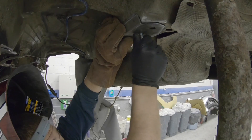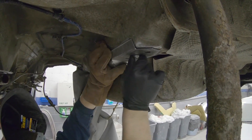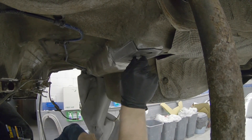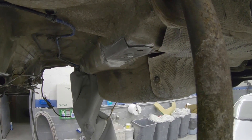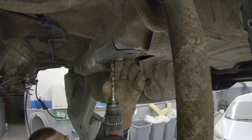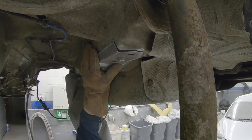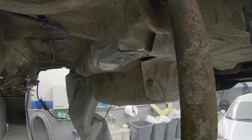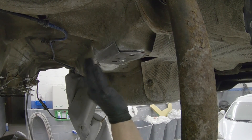I'm going to catch this one and then grab my half-inch bit again to do those rosettes on this one — there are two, so you definitely want to do both. You'll see the change in the metal to know you went just through that outer layer of steel. Now I'm going to make sure you don't over-tighten them — you just want it snug so you know it's centered enough. I'm going to tack that one up.